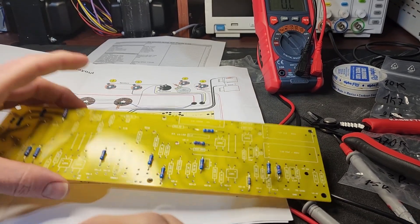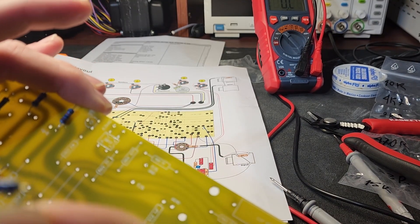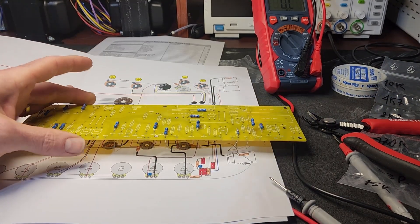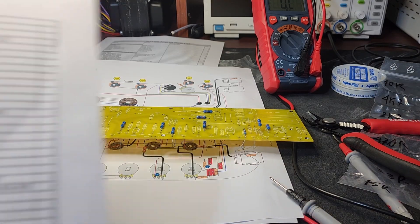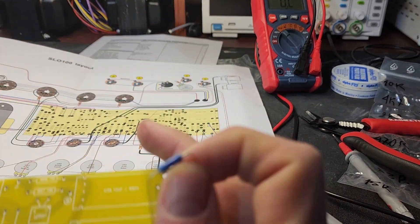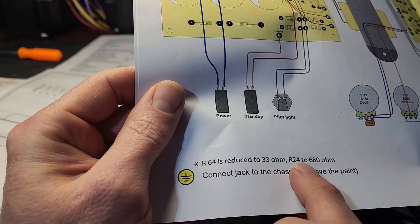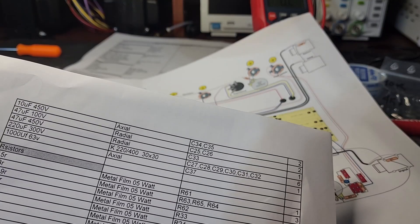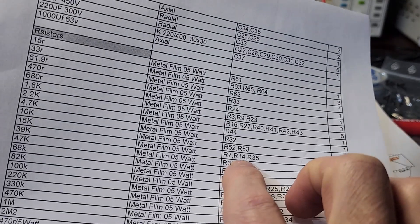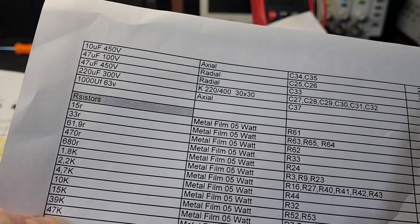This was a little confusing on the schematic - it says resistor 34 with an asterisk. I found down in the notes that R64 is reduced to 33 ohm and R22 is 680 ohm. The 47k is not what we're supposed to be using in that spot. Double-check your work because 47k, 4.7k, and 47 ohm can definitely be confusing.